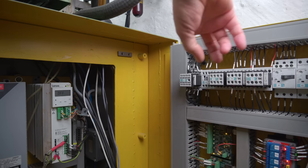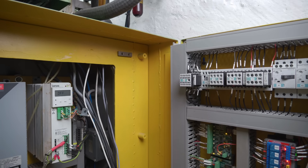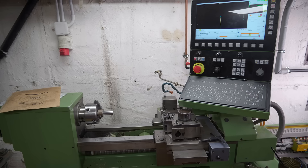What I actually did was put a contactor in front of the VFD so that when I first turn the machine on, some things get powered up but the VFD doesn't — that's activated when I release the machine from e-stop. So with machine on, the contactor closes and powers up the brain of the VFD. When I do an e-stop I drop that relay. There are definitely arguments for using the VFD braking on an e-stop rather than just electrically disconnecting it, but it would be easy enough to change that behavior with LinuxCNC.